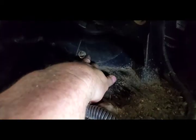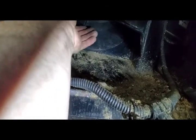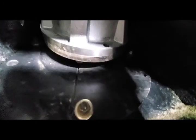These shrouds have to come off. These two shrouds, they're a little bit of a pain to go back in, but you can get them in. You push it all the way in and then slide it around to get it around the other side. And then to get the bolts in, over here you can kind of see, well, maybe you can't, but there's a nut there. You can get all those bolts in from the other side.